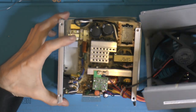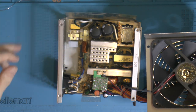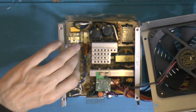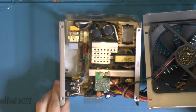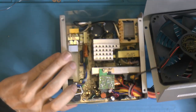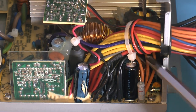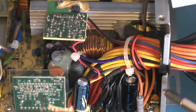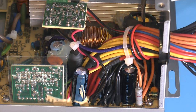And I do see problems here. This brown glue here, I think is what they talked about, being bad in these things. It turns conductive, which is kind of a horrible thing. Apparently they accepted the risk as the manufacturer because it apparently happens after the warranty period usually. But I see another couple of problems here. That one is dead, swollen. Let's see. Doesn't matter, that one is dead too. It has leaked.